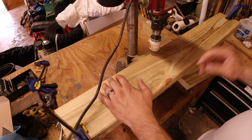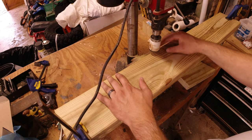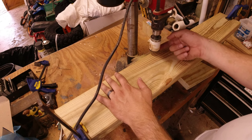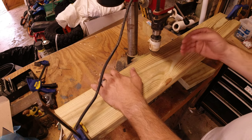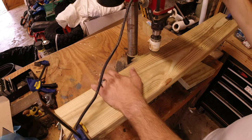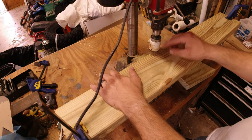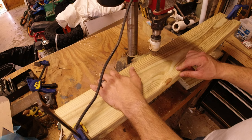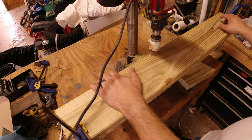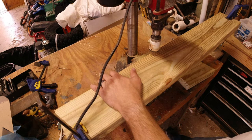Here I've got the front and back pieces on the workbench. I've got the drill press set up with an inch-and-five-eighths hole saw, and I'm going to cut just half — or maybe a little more than half — of the hole saw diameter so the paddle sits in the notch. I have the center drill bit right at the edge of the piece. I've clamped both pieces together, and I'll drill as far as the stroke allows, then raise the bottom piece to finish it off.